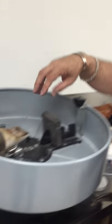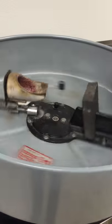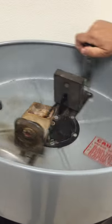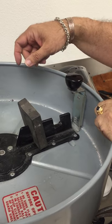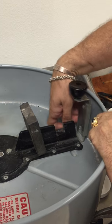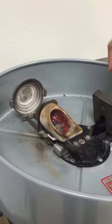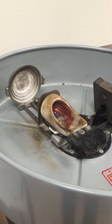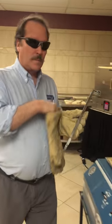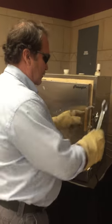To use this machine, we pour the metal in — we've already done that — then we wind it up three spins, lock it in place, and when I'm ready to release it to cast, I just pull the tub and that releases the handle. We cock the arm to get it ready to fling the metal into the flask. Greg's going to grab a flask out of the oven. We've already burned these out overnight and they're at cast temperature, which is about a thousand degrees.